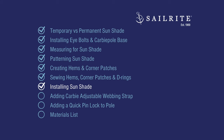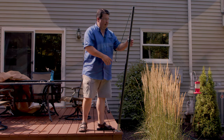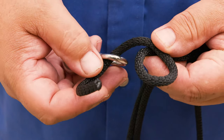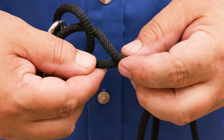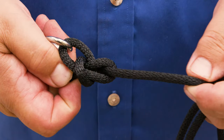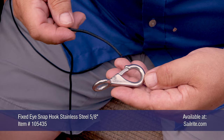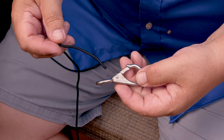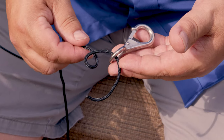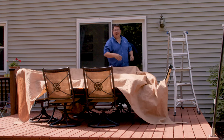Now we can go to the patio and install the sunshade. On to the end of the carby pole line we are going to attach a fixed snap hook for quick installation, creating a bowline knot. This is the line that comes out of the top of the carby pole. We will be doing something similar on the house side, using a smaller line. To attach to the house we are going to use a fixed snap hook with a 1/8-inch leech line, black braided polyester. This line will be attached at the house to the eye bolts. The length of line is approximately 3 feet, which we will trim down later. Here too we will create a bowline knot.